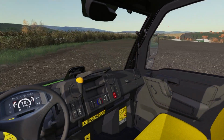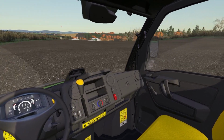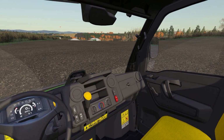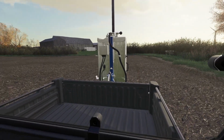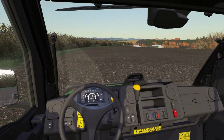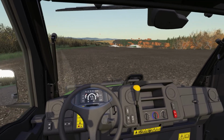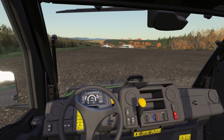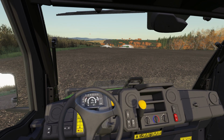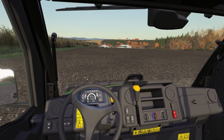The drills, when you get into a certain soil there, will put less kilograms of seed per hectare in, because it realizes the soil condition does not need as many seeds in which to successfully establish. And so again, same thing applies. It allows you to really become that little bit more efficient with how much seed you actually need. A lot of farmers are starting to focus on this a lot more because the potential savings are huge. Combine that with the fuel savings and by being more efficient when you're using GPS as well, you can really start to see your costs come down.